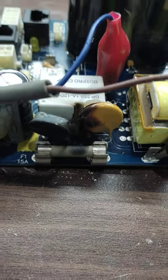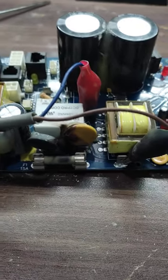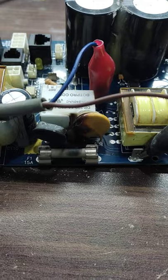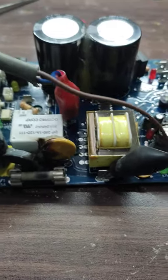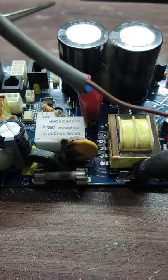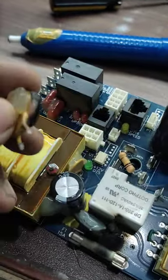So let's take it out. After placing the new component I will show you that the card is working — stay connected. Now we have just soldered out this varistor, and it is hopeful that the short circuit issue we are facing is because of this component.